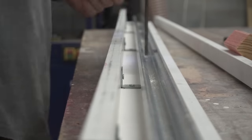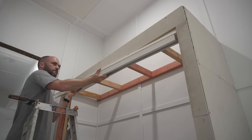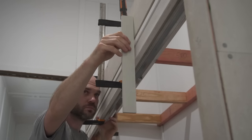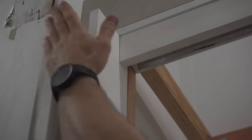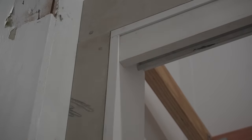When you're installing this track onto the trim, the main thing you've got to consider is that there's enough space between the front door and the pelmet. The other door is going to have plenty of space behind it, but the front door is the one you want as close and tight as possible. I'm screwing the track through the trim and into the stud so I know it's going to have a very solid grip. I was using 50 millimeter screws so they were quite long.